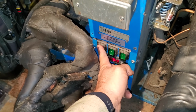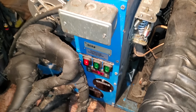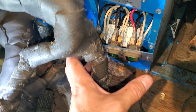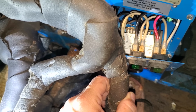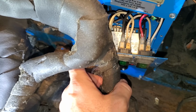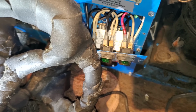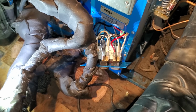So you only have this power switch and the temperature controller is the next thing. So we got to get in that box. I kind of pulled it out. Hopefully nothing shorts out. And I got to get in there and find the contacts for the compressor. See if we can figure out which one's which. It looks like 4 and 5 is my compressor contact. So we'll test across that switch.